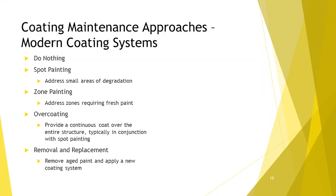So the question is, does that logic still apply to this 20-year-old zinc epoxy urethane structure that's starting to break down? To put it in perspective, it was somewhere between a rating of 7 and 4 — time to start thinking about doing something. We go back to the same list of options, and let me walk through those generically, alluding to the Verrazano a few times.